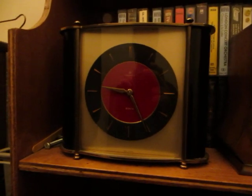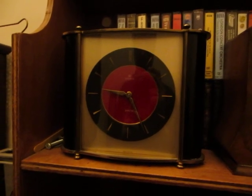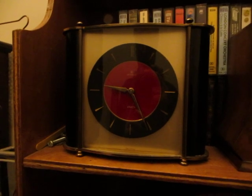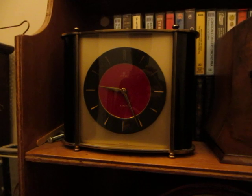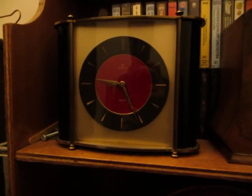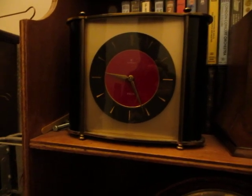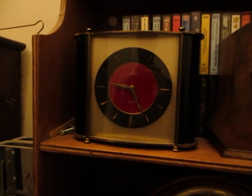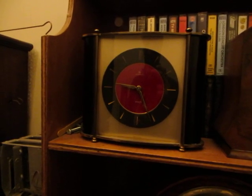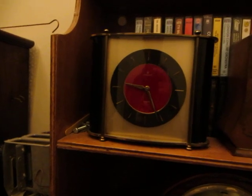This one I bought quite a significant length of time ago, but the movement was severely damaged, so I replaced the movement entirely with one I bought in a scrap clock from a seller in Germany. That was an unexpected completion — I didn't expect that one to be complete for a few years. It had some teething troubles: the striking wasn't striking the right number. It turned out the rack tail was missing the snail sometimes, so that had to be adjusted.